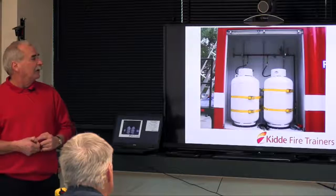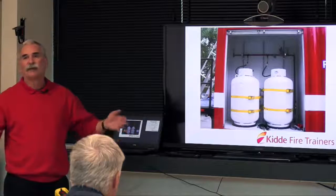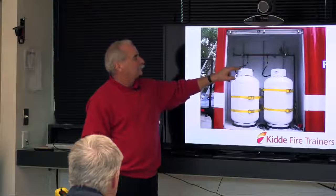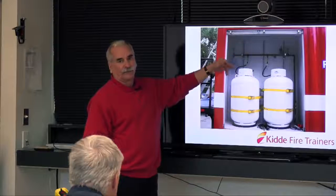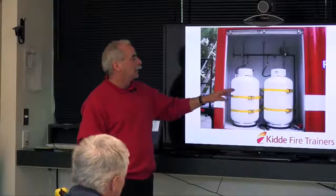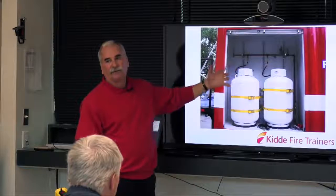The propane system: up at the front we have two 420-pound cylinders that feed into a main gas manifold. Anytime you're doing training, both tanks are going to be fully open — we want to draw the maximum amount of vapor off the two tanks at once. We come off the tanks, up into our main header. There's a tank valve, some other things we'll look at when we're out there, and an isolation valve which is primarily a service valve. From there it goes through a strainer, which takes out any particulates in the gas — very rare with new tanks.